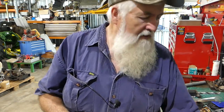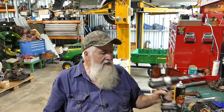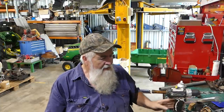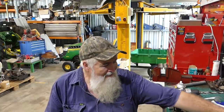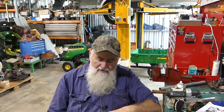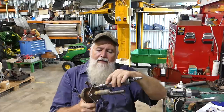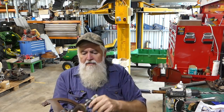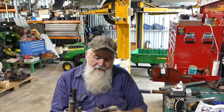So I actually, mine were catching a little bit. So all I did was I got the drill, put it in, gave it a rattle around, and that wasn't quite enough. So then I went and did the job properly. I got the die grinder. And look, you don't need to open up bigger. You just need to take any burrs away just so that little spacer slides back and forth nicely. I used a little right angle die grinder with a buffing pad on it to polish up in here and polish on there. So it does leave a nice smooth surface.